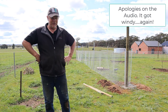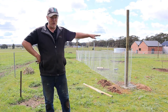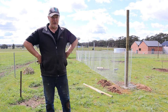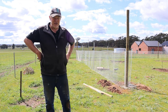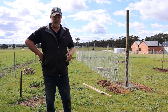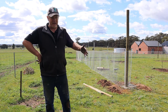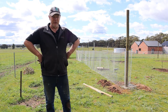Next step — just completed rolling out the first roll of wire. We've rolled it out alongside, stood it up, and temporarily clipped it up to the top high tensile wire just to hold it in position. We're going to stretch it so it's reasonably tight — it doesn't have to be extremely tight, as it's very heavy-duty wire and will stand up under its own weight. We'll just make sure it's nice and tight and flat, then secure it on the corner and tighten this back run as well.